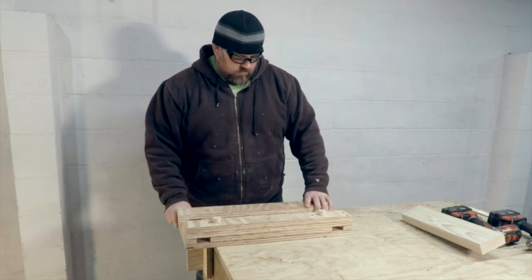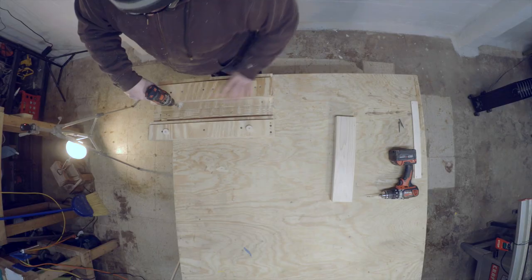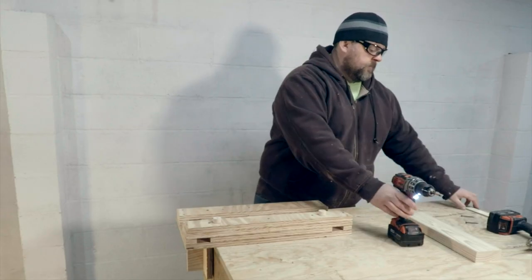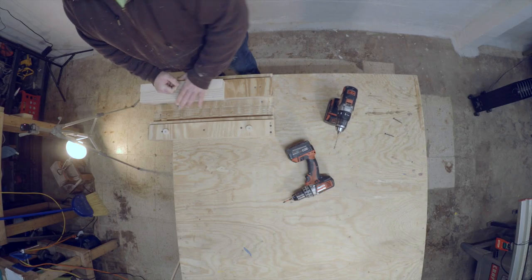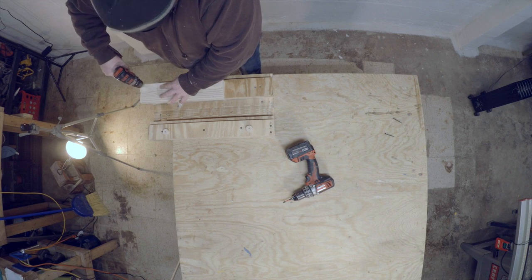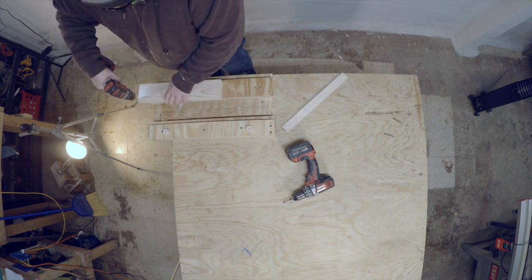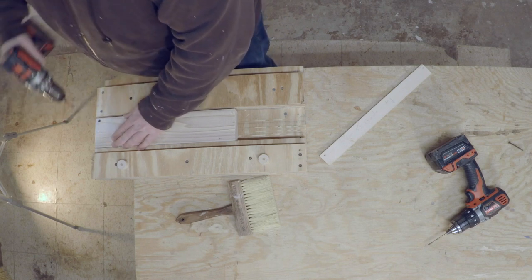First thing we need to do is get our jig secured to the table. I'm lining it up with the edge of the workbench and I'm going to use inch and a quarter screws to secure it to the table. What I'm working with here is a little guide I made just to get the drill holes in the right place of our stock. Our piece of 2x4 has been ripped down to the overall dimensions of the end bars, which is 15 and 9/16 inches. I used a 9/64 inch drill bit to make the holes and I'm putting 2 inch drywall screws right through the 2x4 and into the jig.